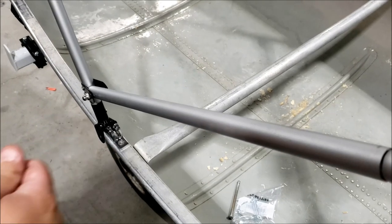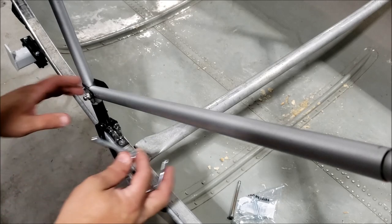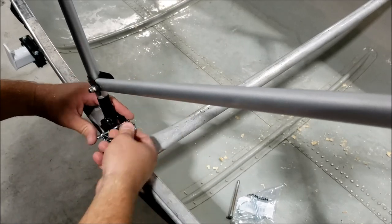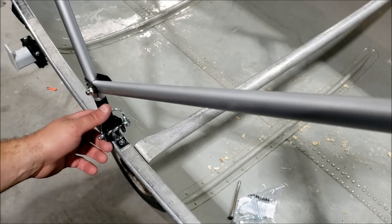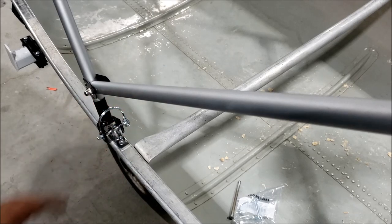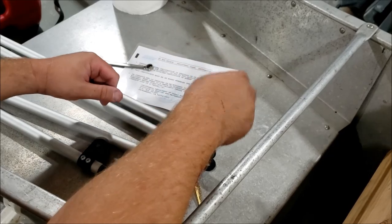For safety, I don't want to run a bolt in there. I need to run a pin. Should this thing flip over or capsize, you want this top to be able to be removed, because with that top on, I don't think you're flipping the boat back over. So in the event that happens, you need a way to quickly remove the top. And sadly, you're ditching it, but let's hope that hasn't happened. But put the spring clips in there, so pop that off, pull the pin off. Bye-bye, top.